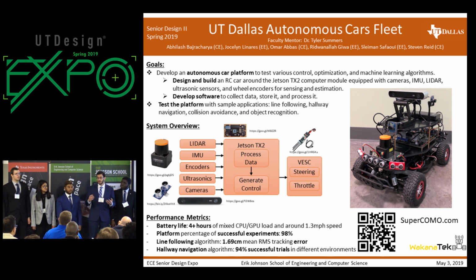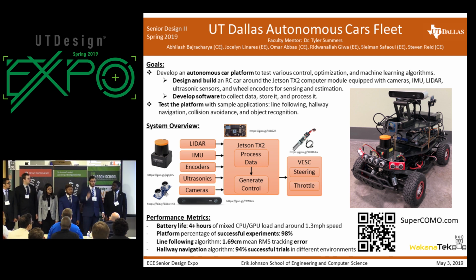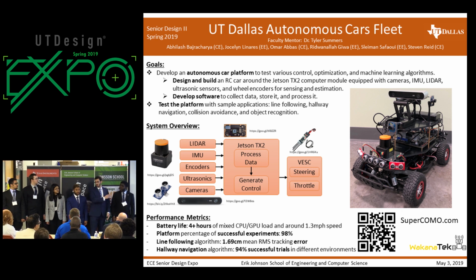To perform autonomous driving features, we need the actuators, sensors, and processors all to operate together. But all of these different components have their own software packages. And so to integrate all of these different system components together, we rely on ROS, the Robot Operating System Framework. With ROS, we can manage all the different devices, transfer data between processing nodes, and issue control commands. And then we can use one file to start all the devices we want and the control pipeline.